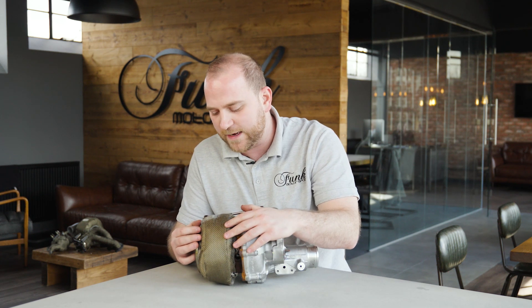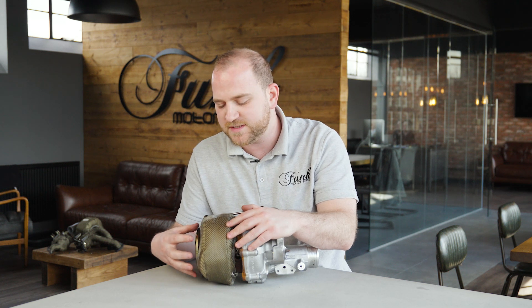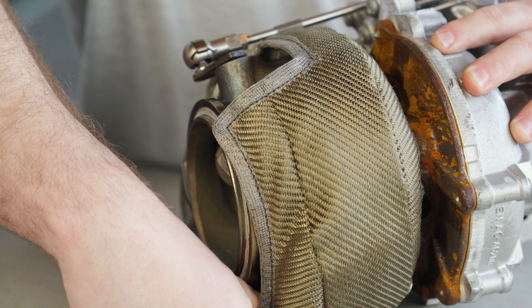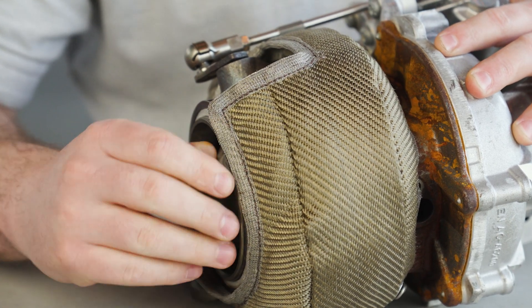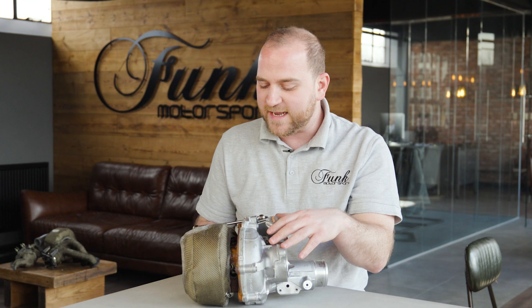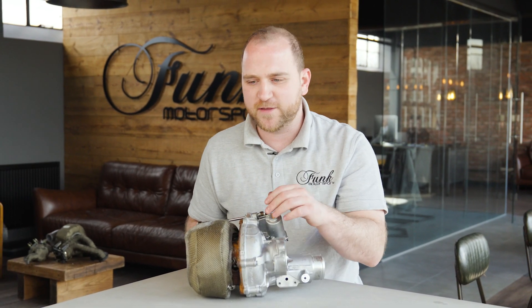You'll also notice the blanket is quite wide in this section and at the moment it's sat the wrong side of the flange. You will obviously have a clamp on here, but you'll want that to be on the opposite side of the flange or just sat on top, so there isn't any burning on the outside of the blanket where the heat isn't supposed to be. Then you just need to pull the blanket down so the actuator isn't interfered with.